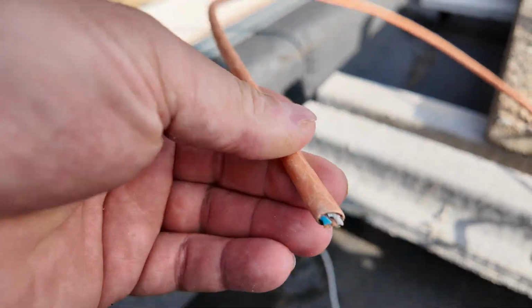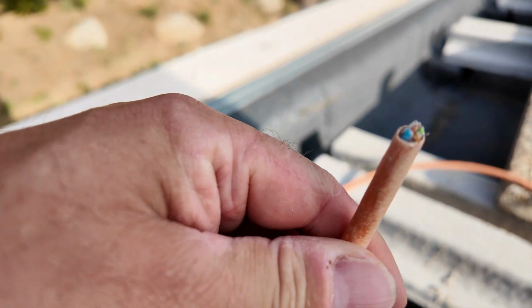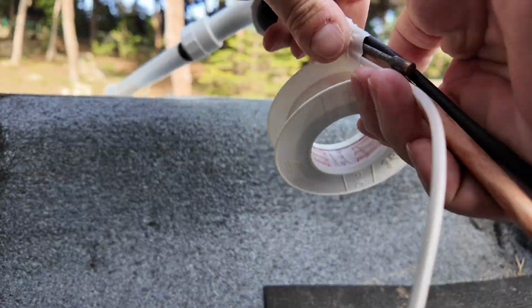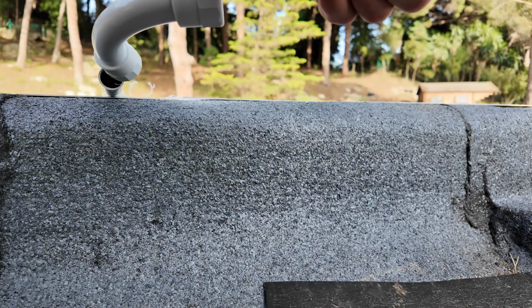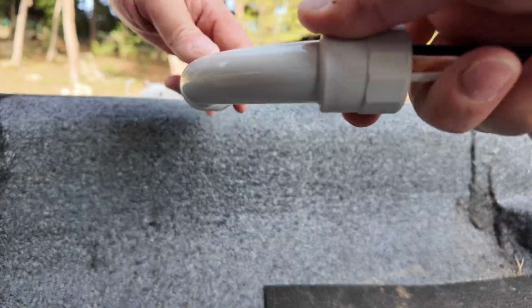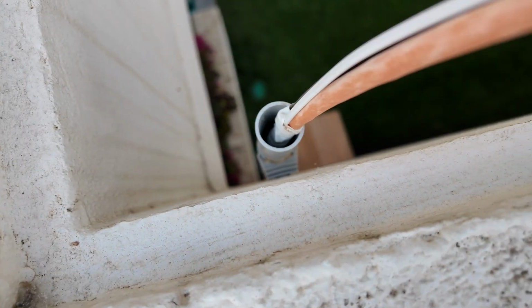One other module which will come in the next video needs 4 wires, something like this, but for future proofing I pulled a normal category 7 cable, which gives us 8 wires plus the shield. With these 3 cables, a 25mm pipe will be absolutely okay. I hope it will not get stuck somewhere in the middle. Let me check. Yeah, we are going through. So 25mm is enough. If everything is right, then we simply feed into this vertical pipe very nicely.